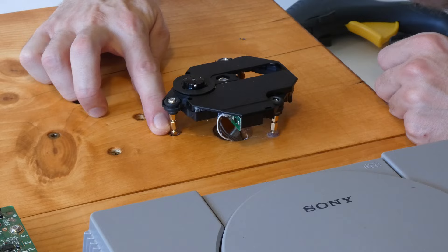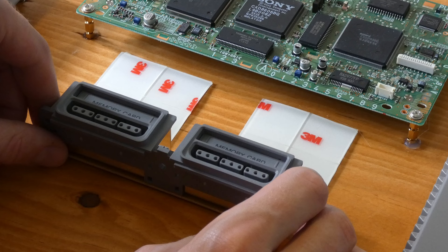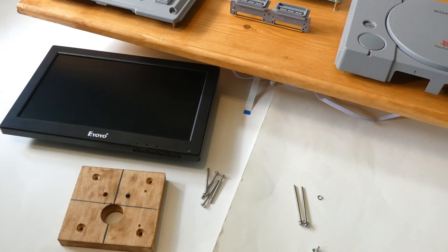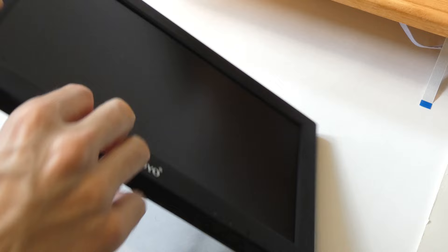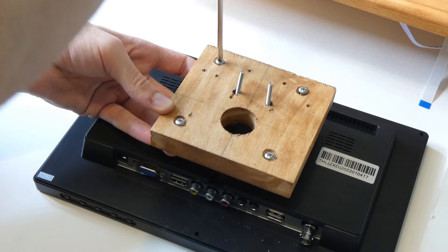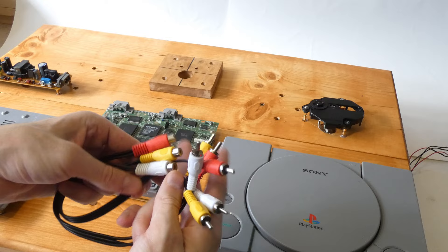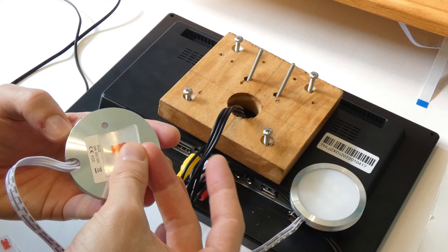Time to install the controller ports. I thread the ribbon cable through the little hole I drilled, and for this I used little square 3M pads as a ruler guide, then took the hot glue and glued it on the circuit board, quickly sticking it on the wood using the 3M squares as a straight edge. I think it turned out nice. Time to put the monitor on — I pick up the monitor mount, thread in four little machine screws, grab the monitor, put in the two bolts to attach it to the back plate, screw on the four machine screws to the back of the monitor, give it the shake test, and I'm satisfied. For the RCA cable I got a little splitter so I can have it attached to the small monitor but also easily attach it to another monitor. Can you say more LED pucks? Two of them on the back of the small monitor — should look pretty cool at night.